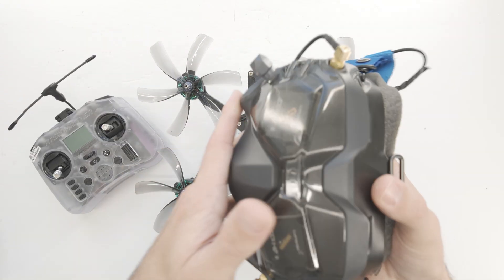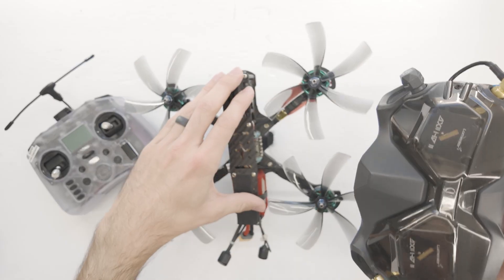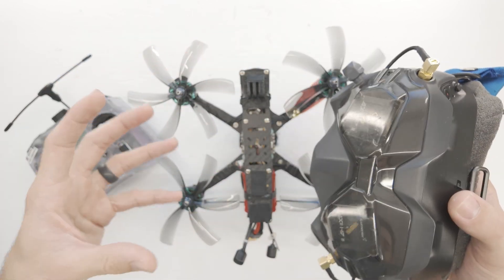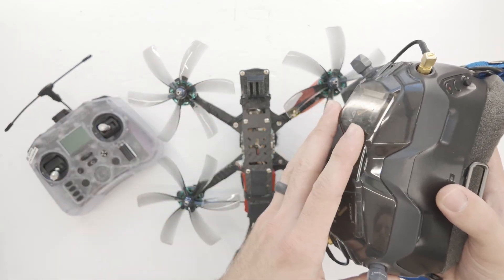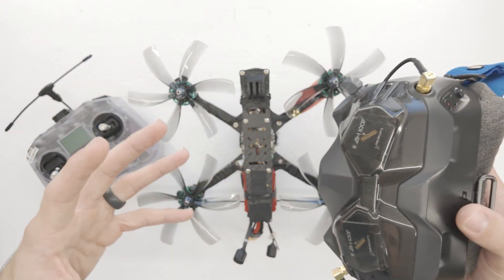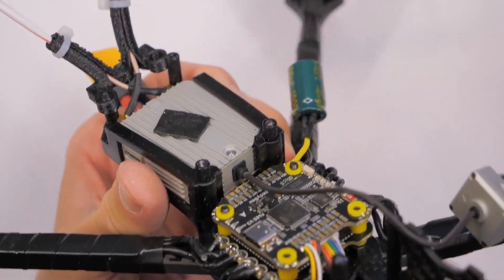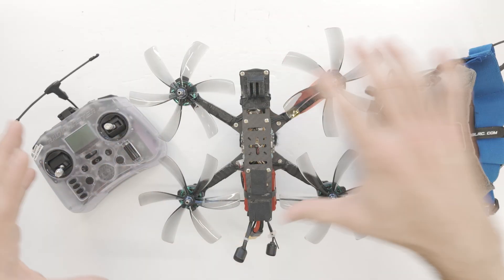Another important factor is that the goggles that you choose need to be compatible with your FPV system. The camera and the video transmitter that are on the drone need to be compatible with your goggles. So that might mean that they need to be the same brand — for example, DJI makes the video system, they might need to all be compatible that way. Or if it's analog, which is more open source, you need to make sure you're using the same antennas and different factors like that. So your goggles need to match up with your video system on the drone. That's going to pretty much cover your main flight system.